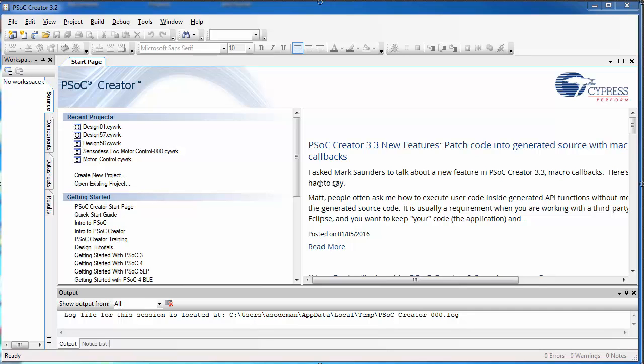In today's lab, we're going to be building a fairly simple 2-degree of freedom RP manipulator. That means that our first joint will be revolute and the second joint will be prismatic. We're building a manipulator that has only 2 degrees of freedom because it'll be easier for us to do our inverse kinematics and eventually the Jacobian matrix for this manipulator than it would to do it with a 3-degree of freedom manipulator. So we'll start with this more simple manipulator to learn how to do some of these more complicated mathematical things like inverse kinematics.